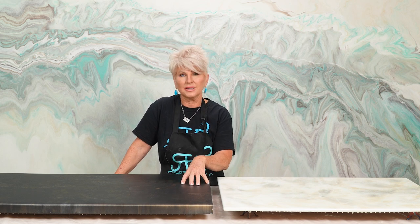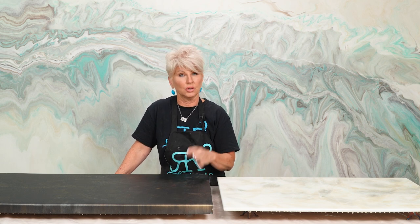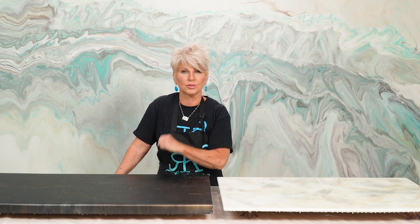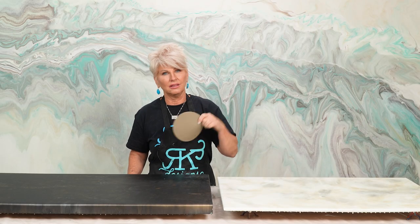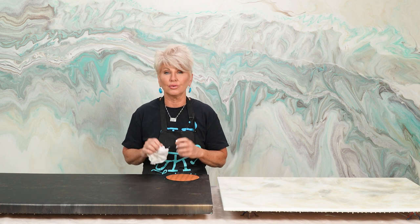I get comments about sometimes the UTC feels like a laminate. It's just not uber smooth like you get when you sand or hone an epoxy surface — you can really get it super smooth. Let me give you a tip on getting your surface super smooth. What you'll want to do is start off with a 10,000 grit sandpaper. These are amazing — I'll put the link in the description and you can get that off of Amazon. What you'll do is wet sand.